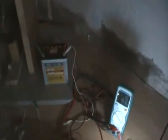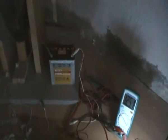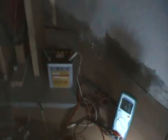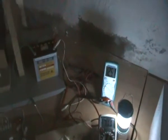So it's probably the first problem which most people have: to control the voltage of the primary battery, because if you discharge this battery many times below 11 volts, you probably damage the battery and you won't get results anyway. So just think about voltage control of this battery, and actually on this side nothing controls it, because you just wait until the battery is charged.